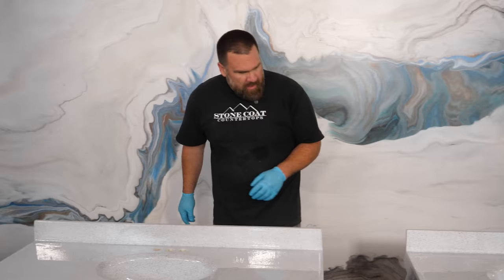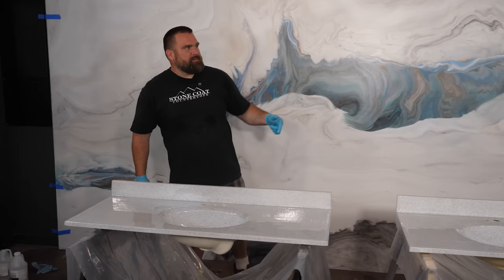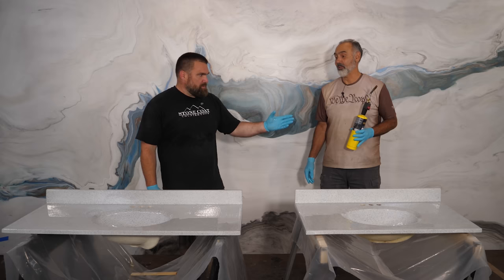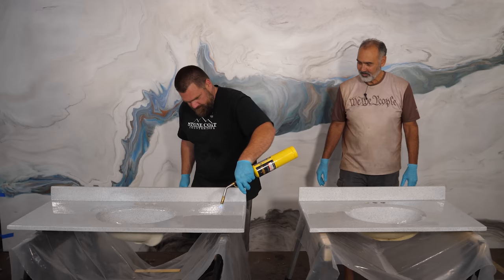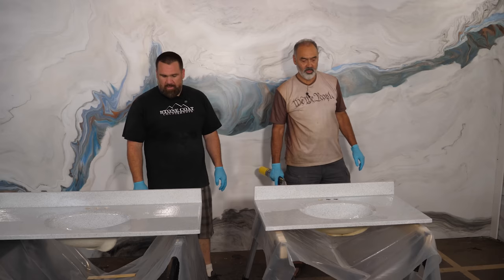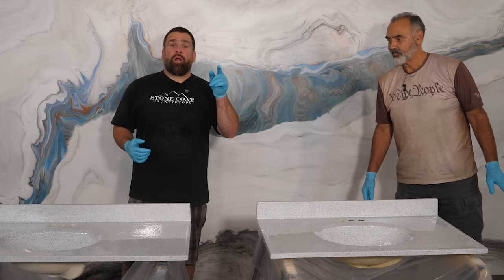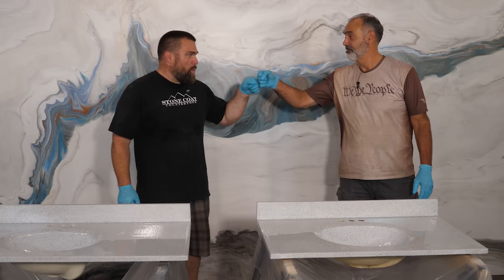That's perfect depth. Good job. This step is done. What you've got here is just the high points of the stone spray — the next coat will really smooth it out. I'll come back tomorrow and lightly sand with 220. Once this dries — it'll be dry in 18 to 24 hours — I'll come back, lightly sand with 220 grit, and do the same exact process. Tomorrow I'll be back for the next step: one more clear coat, and then it's the ultimate top coat. Then it's install. Way faster than the seven-week wait your brother-in-law had, right? And for less money.